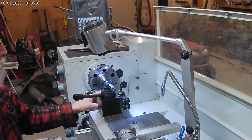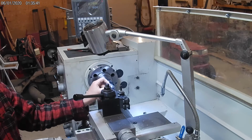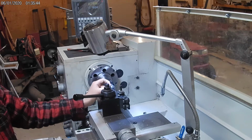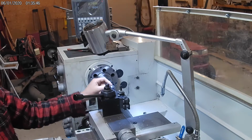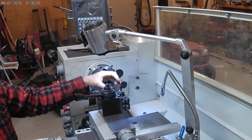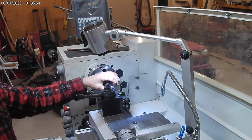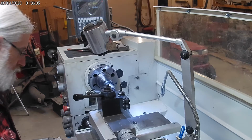So I'm going in 3/4 of an inch, which if I have the maximum 1/2 inch cutter on there, that'll leave me a 1/4 inch lead in on the centering piece, so it doesn't move around. It keeps everything positioned accurately.